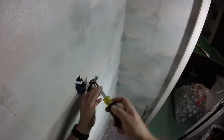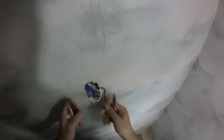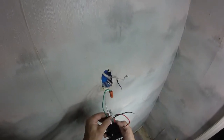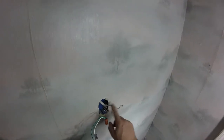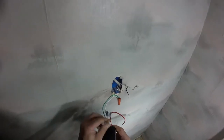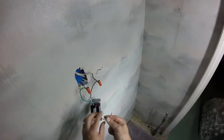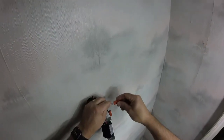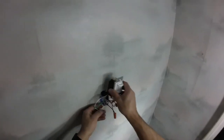All right, after you've got it pulled out of the wall, you want to disconnect the wires. So once you get the old switch out, you're going to start putting the new one in. So the white in this case is the neutral — normally would go here, but the way this is wired, the hot comes in and then this powers this one out to the light. So this is going to be tied to my hot, and this one here goes to the load, which would be the one that turns on when the sensor picks up movement — so that's going to the light. This is not meant to be an educational video; it's meant to be for entertainment, so I encourage you to hire an electrician to do any wiring in your home.